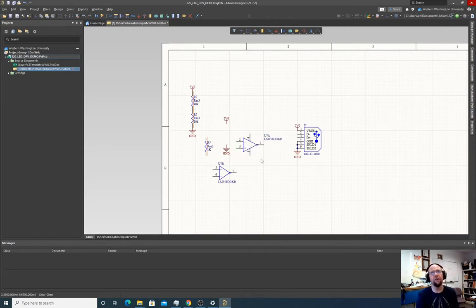Okay. All right. So we found a workaround. It's not a great workaround, but we found a workaround. One thing to be careful of now is pin 8 still needs to be power. So the power still got to be here. And by convention, we don't like to put these ports upside down. So unfortunately, flipping it made the angle right. This is a bad op-amp part. Normally, op-amp parts would have the power pins labeled, because it could be confusing here if you didn't know what you were doing. Okay, so now is a more traditional circuit.